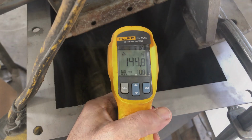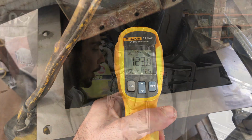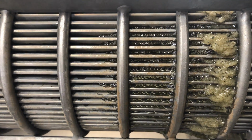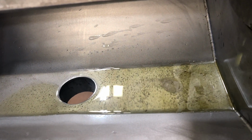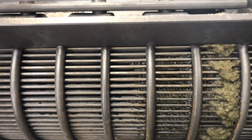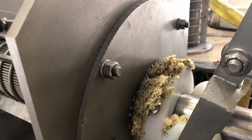Those hemp hearts have been steamed along the conveyance of the screw conveyor. Okay, so we're beginning to see oil. If we look at the screen, we're actually getting a nice, clear-looking oil coming out through there. So it is mixing with the water. We have steam going in there to heat it and help it get the oil out. But if we look between the wedge wires, we are getting some fiber on our last stage of compression there. We have our press cake coming out.